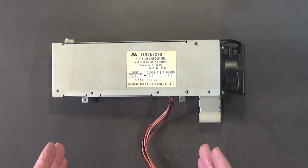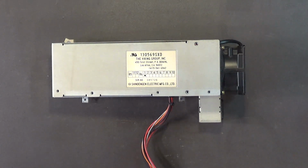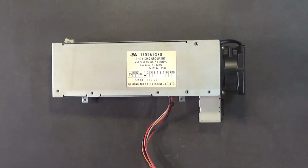But on a through-hole motherboard, usually, now a lot of you are going to disagree with me, but you're amateurs, I'm a professional. I know what I'm talking about, okay? So listen to what I'm saying. For the most part, you do not need to recap a vintage computer board that has through-hole electrolytic capacitors. Those are very high quality capacitors. They rarely ever leak. They rarely ever go bad.